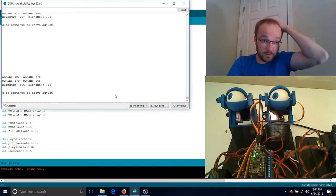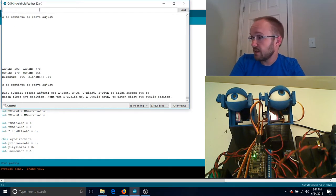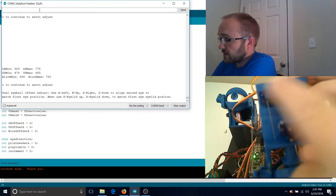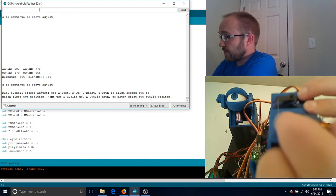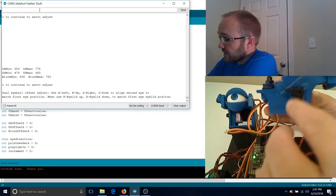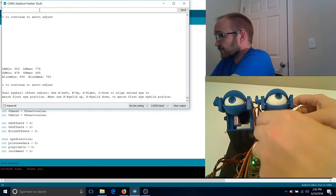Now that we have the input limits, go to the serial input, press C to continue and hit enter. You'll hear the servos go — your servo horn should not be hooked up yet. Once you hear the servos reach a center point, go hook back up the servo horn. The servo horn should be roughly parallel to the servo body. Get it in this general area — we're going to calibrate it, but this is what we're looking for. Put your horns on both eyeballs if you made two.